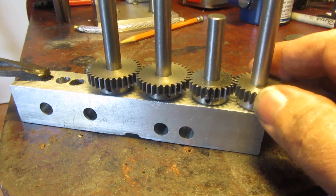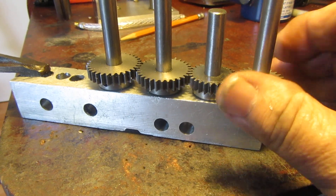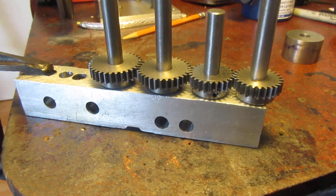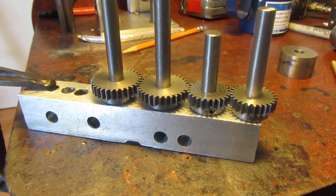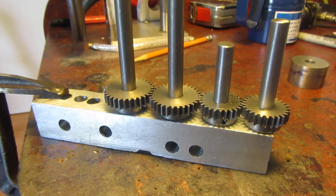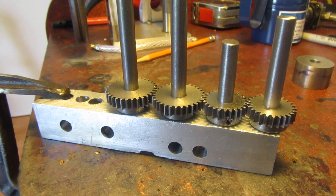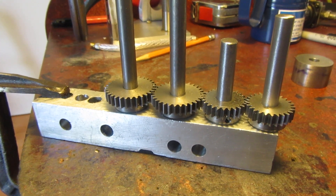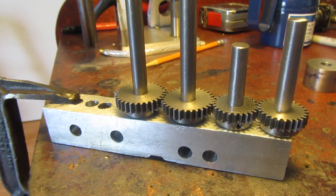This is a bit of a lifesaver. I can see everything meshes without any issues here, but I have spent many hours filing and finessing gears that don't mesh very well, so I always do what I've shown you there — just to check and make sure that when I build a frame with the holes at what I've calculated, the gears will really mesh. Thanks for looking.